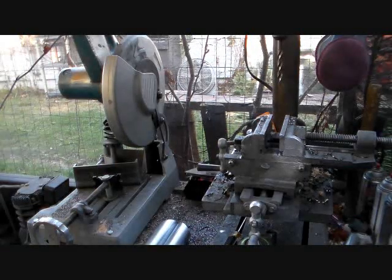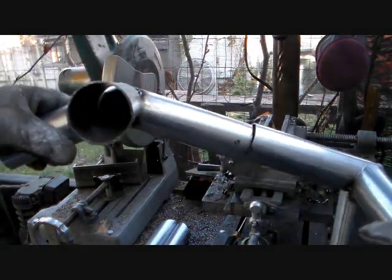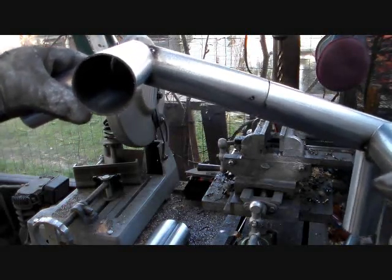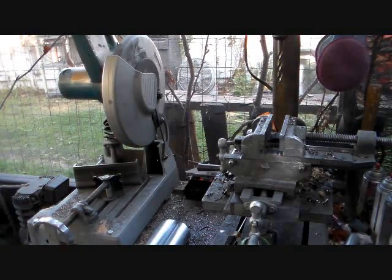And when you get done, they should come up to meet each other. Both your angles should set just like that. There you go. That'll give you a 20 degree angle roof. It's a little more complicated than a 30 degree, but it's a lower pitch and it tends to match the house a little bit better. A lot of houses are set at about 22 and a half degrees on the roof, so when you set this next to it, it doesn't look out of place.